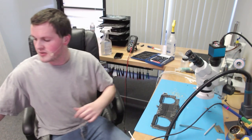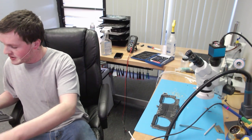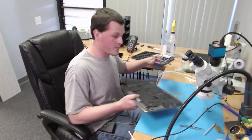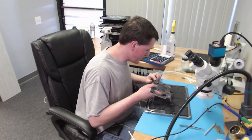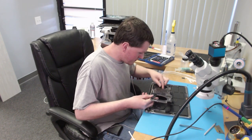I have the enclosure right here. So I'm just going to slide it in and see what we get. Now, it's very, very important on these, you gotta connect a battery no matter what kind of charger you use. I've been trolled by this. I've seen people get trolled by this. If you do not connect a battery, it will not work. So, we will do so.